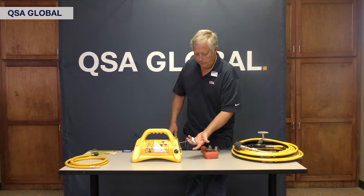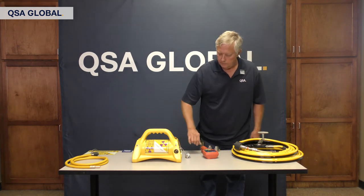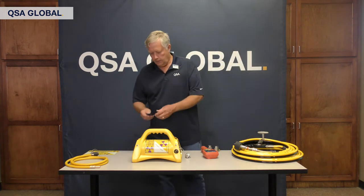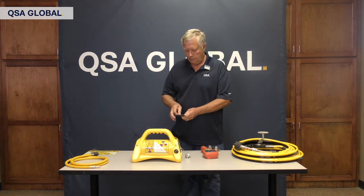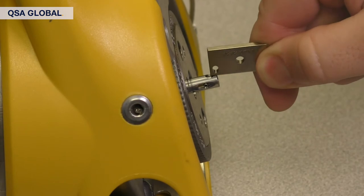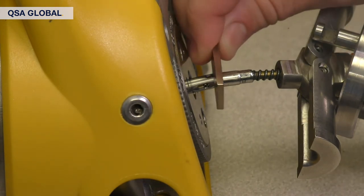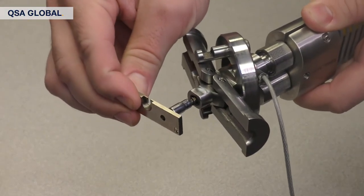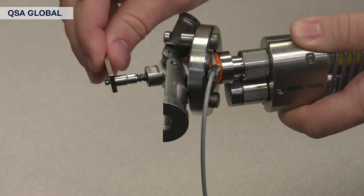Next, unlock the camera, operate the selector ring, and remove the cover. I do a visual inspection of my source connector right here — I don't want to see any flowering or damage. I have what's called a no-go gauge, something unique to QSA Global. I'll remove it, and with this no-go gauge I can check the female gap right here. I can make a connection with my drive cable and check the gap between the drive cable and the female connector. Should these gaps pass through, it is a no-go situation.